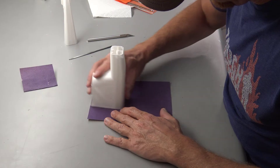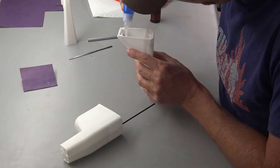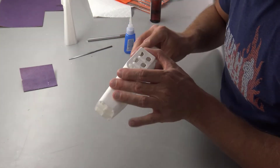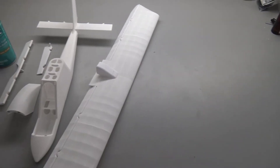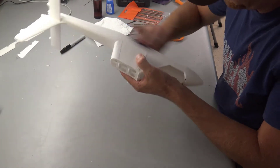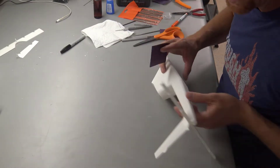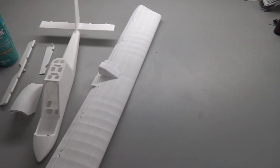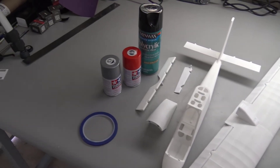The parts are assembled similarly to designs shown in my past videos — a quick sanding of the joints to create some grit for the glue, then using a basic medium-bodied super glue or CA and some accelerator to create an instant bond. LW PLA is a bit more flexible than PLA, so I decided to incorporate carbon fiber rods through the fuselage to increase its strength. After the main components were assembled I decided to smooth and paint the parts before final assembly. After sanding with 220 grit and 400 grit sandpaper and cleaning with isopropyl alcohol, I sprayed each part with one to two coats of a water-based polyurethane spray to seal them. This also helps fill in layer lines, stiffens the parts up a bit, and makes masking tape and decals stick better.